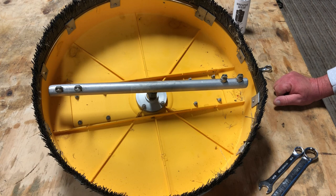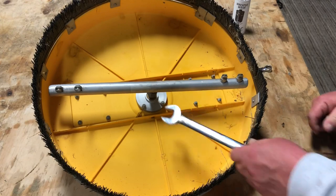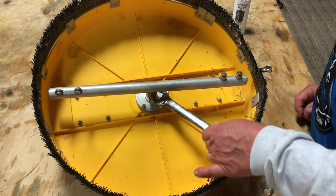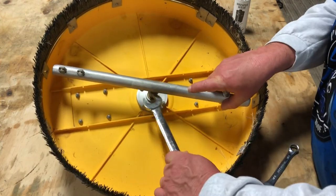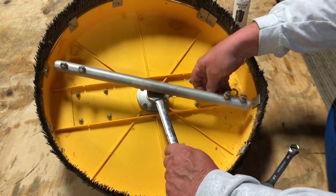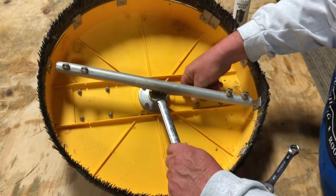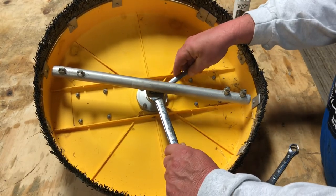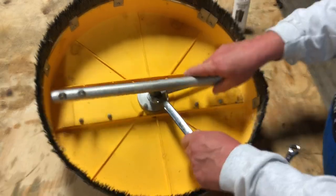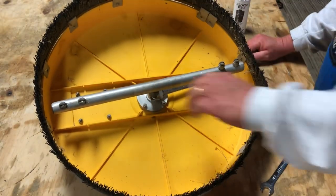The other thing that happens is sometimes you have to replace the cartridge or you have to replace an O-ring on a cartridge, and that involves taking the actual surface cleaner bar off. For that, you want a 7/16-inch wrench up at the top and then a 9/16-inch wrench down at the bottom. What I normally do is take this and turn it upside down so it kind of pins inside one of these bolts or against a ridge, and then I can remove the surface cleaner bar fairly easily.